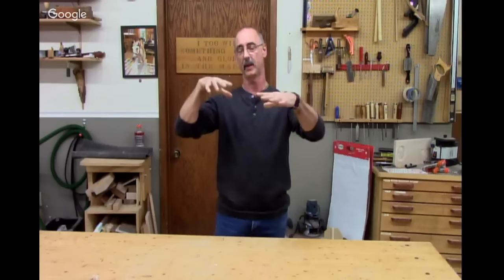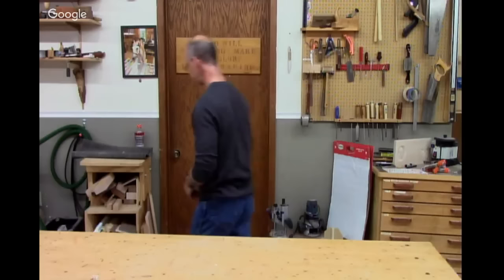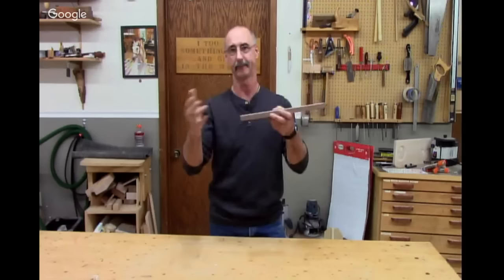Could you discuss the advantages and disadvantages of air-dried versus kiln-dried wood? Air-dried versus kiln-dried — there are a couple things we could talk about. Air-drying mechanically is much easier to set up: you take boards, stack them, put a sticker in between, another board, a sticker. The bottom line is you've got to have airflow top and bottom on every board. As a general rule of thumb, you're leaving a year of drying per inch of thickness of material.